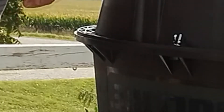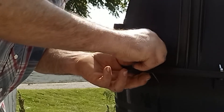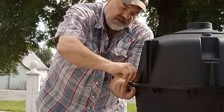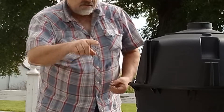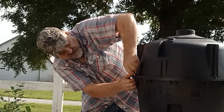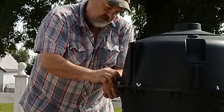It's really important that you use the lock washers, because with just finger strength on a wing nut, you don't want vibrations from when it operates to loosen up the wing nut — that would create a void and cause leaking. So I put the bolt, lock washer, and wing nut on with only a couple of turns — I like to call it wiggle room. What's nice is the bolt goes up into the hex cutout and holds it for you. My recommendation is to not tighten them up until they're all put in, otherwise you'll never get some of them in. Run it down, then back it off a little bit so it pulls up into that recessed area.